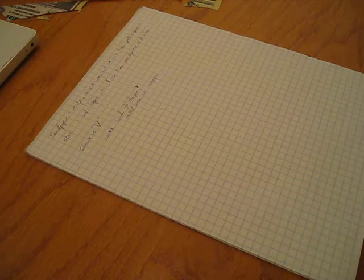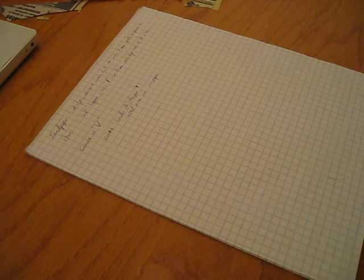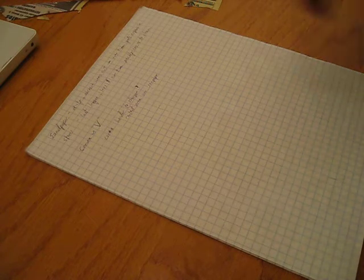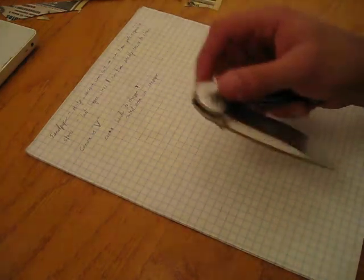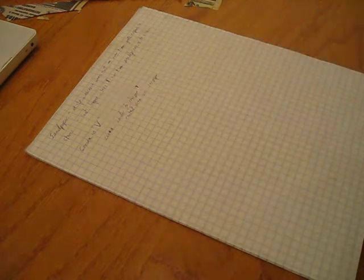Over the month or two I'm still very happy, but I've realized some of sandpaper's limitations. Even at 300 grit, it's not as aggressive of a cutter as stones, I would think. I never had a real quality stone — just a cheap $5 stone from Home Depot. But from what other people say, certain diamond stones cut very fast and aggressively. Sandpaper doesn't really do that. I would guess that 300 grit sandpaper versus a 300 grit diamond stone doing the same number of passes, you're going to have more material removed with the diamond. That's just my guess.